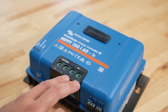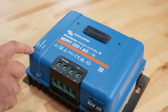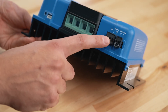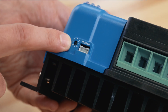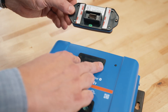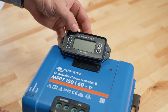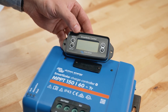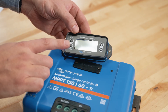Let's talk about some of these ports. Here's your input from your solar panel — your PV voltage — and here's what's going to your battery, your positive and negative. Here are your indicator lights letting you know what stage of charging you're in: bulk, absorption, or float. Here you have options for a remote control, a relay, and your standard VE Direct port. There's also a rotary dial to select which battery chemistry you're working with. There's also a really cool Victron accessory called the Smart Solar Controller display — it plugs in right here. You remove these two screws, take off the adhesive, stick it on, and mount it back. It shows you everything going on on screen. You might find more visibility in the Victron Connect app, but for some people this is peace of mind — if you'd rather see it on the device, this is Victron's solution.